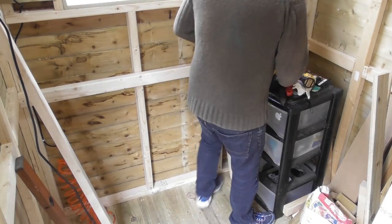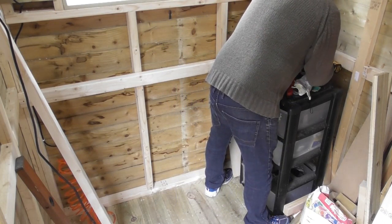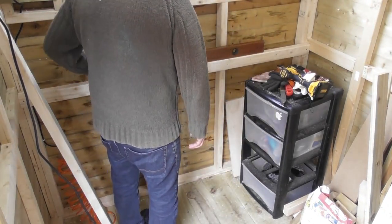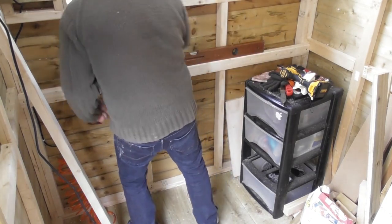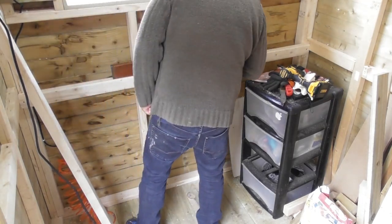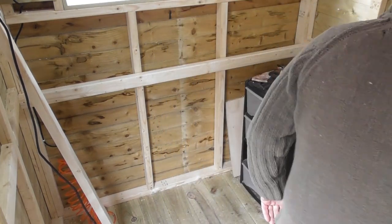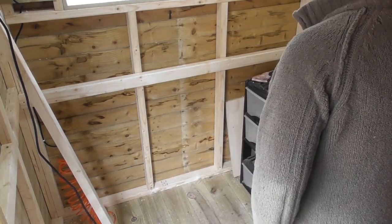So I've marked a line. You can see my bracing timber on the outside wall at the back. The worktops are 28 millimetres thick, and I've marked a line so this side will have to go lower down to suit — I'll have a bit of a lip on the outside but I'm not worried about that. I pre-drilled the hole, put the level on there — it's got to go down a little bit that end. Checking the bubble: on the nose. So that back rail for the rear of the worktop to sit on is dead level. I'll whack a screw in the other end and into those centre uprights — happy days.